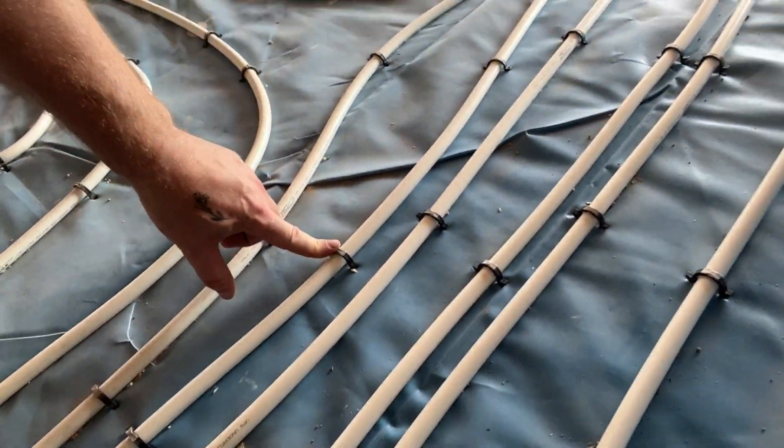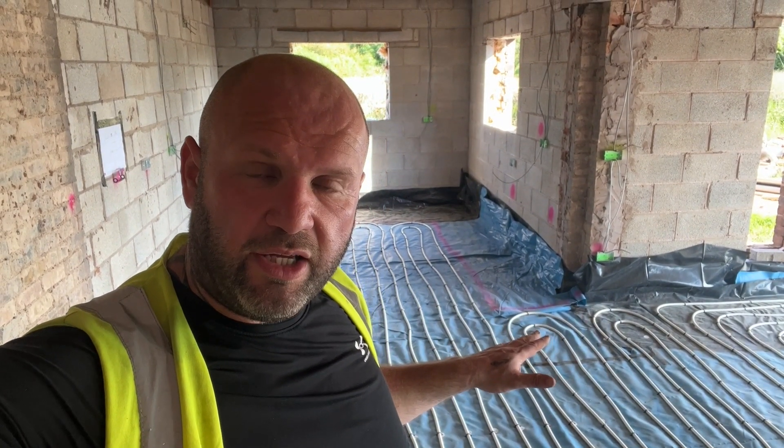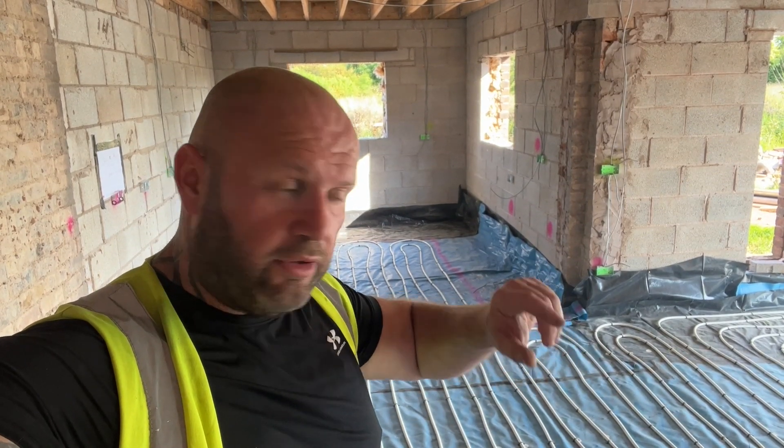The reason we do it this way for underfloor heating is so that the hot water pipes are straight on top of the insulation. One, it's easy to clip them down into the insulation using these clips as you can see. Two, we want this to save as much heat as possible — being directly on top of the insulation means it hasn't got to transfer through the concrete floor slab, making it more effective and efficient. So the difference between underfloor heating and non-underfloor heating is you flip around the insulation and the concrete. That's it folks — stay tuned for the next video, see you soon!